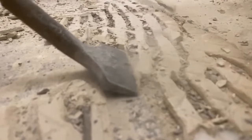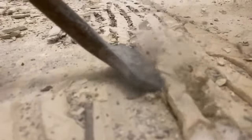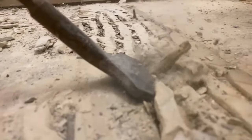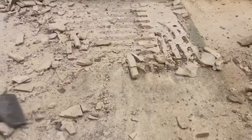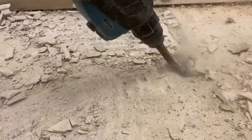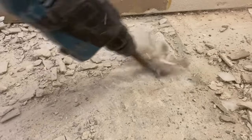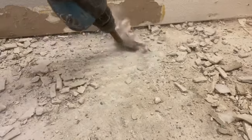I like to put a little bit of pressure downward into the concrete slab, because the concrete is much harder than the mortar, so the chisel will just kind of glide along the surface of the concrete and pop the mortar right up. The mortar is a lot softer than the concrete and it basically just pulverizes it, leaving you with a nice smooth surface to work with.